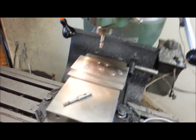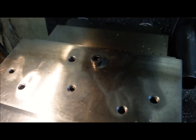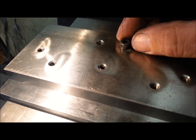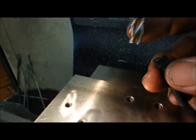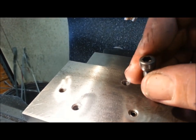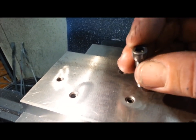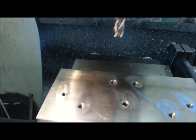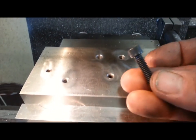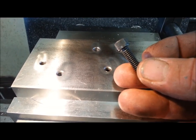This is a quick short video. We've got some holes and a quarter-inch bolt, and we want to counter-bore them. I've already picked a three-eighths end mill, which fits nicely on a hex head or socket head screw. When you're setting your depth, you could go to a bunch of trouble and do a bunch of math, but I've got a quick and easy way to share.